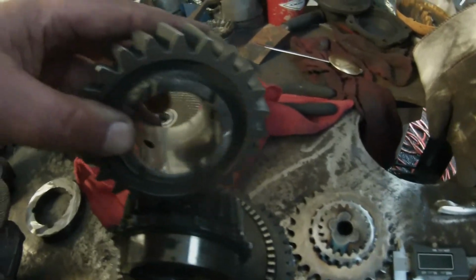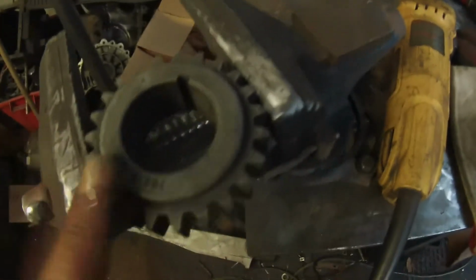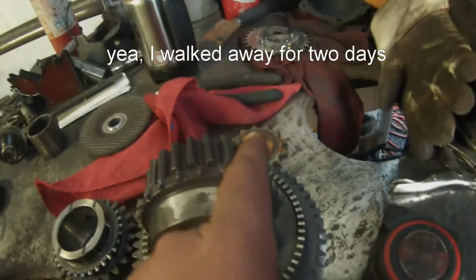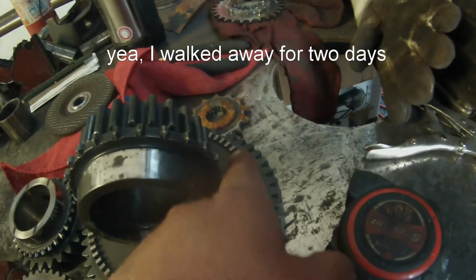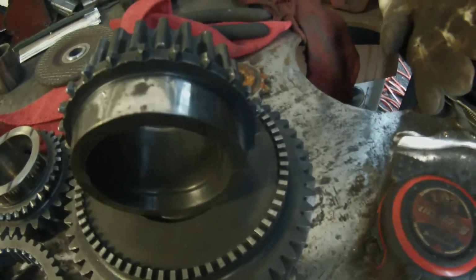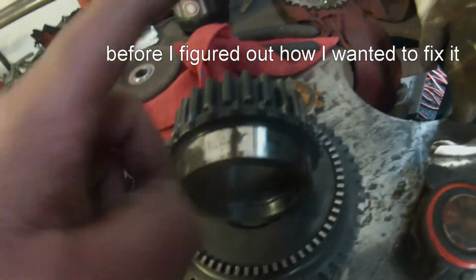Anyhow, so I'm going to try and get a measurement. I'll probably tack this one in so I can hold the other one and tape measure, and find one more. Okay, oh wow, that sucked. I've got this gear here and this gear here because there's no way I'm going to add just one gear in the middle to gain 3 inches and ruin the whole idea I had. Screw that. So I'll put one on this side, one on this side. I need to be 10 1/4 inches off of this edge right here, this little lip, in order to make that pendulum clear on that base. So that's what we're shooting for, and I'm going to start cleaning this up with a wire wheel, touch up with the flap disc to make it shiny, and then this guy is next. I'll probably have to get the Dremel out as well, and probably next time I turn this on I'll have gears tacked in place.